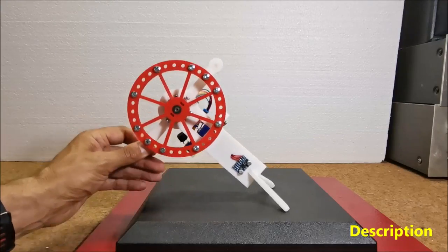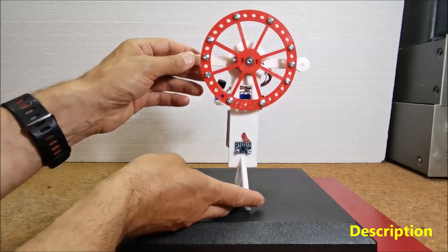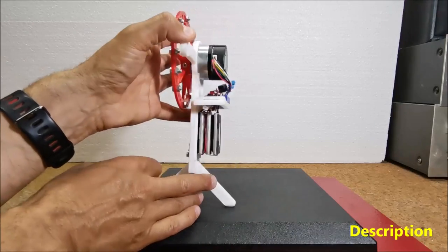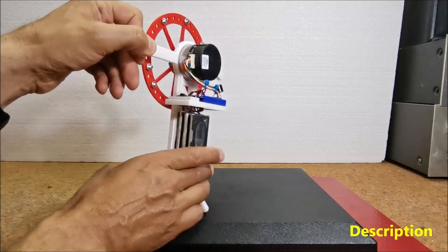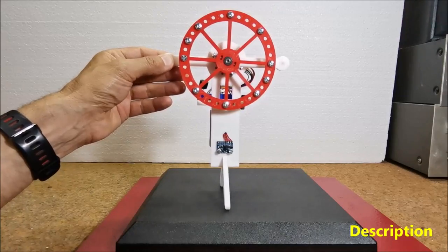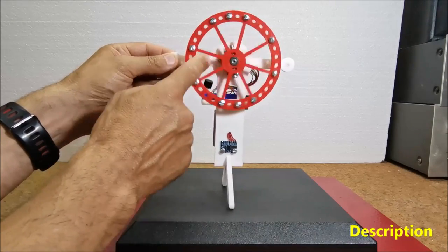In our case, the MPU6050 sensor collects data of the position, more precisely the angle of the device, and sends that data to the microcontroller, which performs calculations based on previously given algorithms and constants, and sends the result to the electric motor, which with its movement tends to hold the device in the desired position.